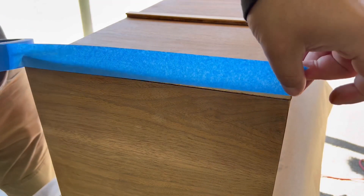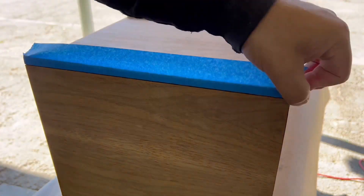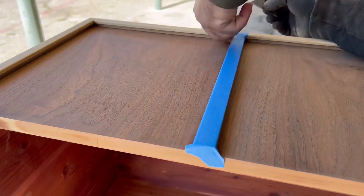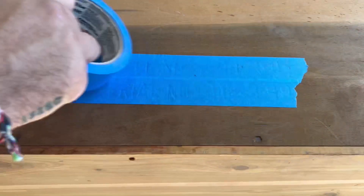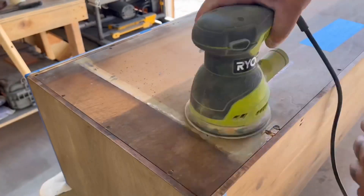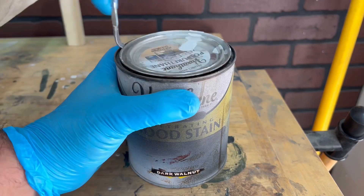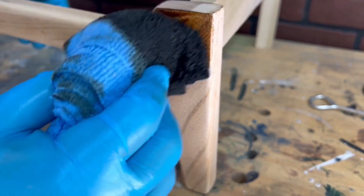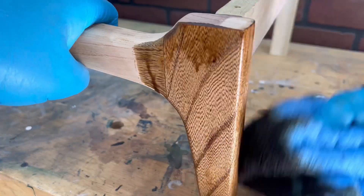All the trim pieces on the front have to be taped off because I plan on doing those a separate color from the body — especially since they're two different types of wood. I believe the veneer is like a walnut and the front is some sort of poplar; leave a comment below if you can identify it. I also taped off the serial number on the bottom and will just scuff-sand it. For this piece I'm using a dark walnut Varathane stain — it's oil-based, takes quite a bit of time to dry, but because of the difference between the woods it'll give a nice contrast between the body and all the trim.